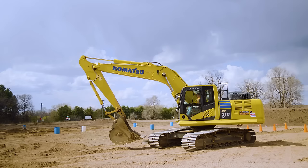There is no right or wrong here. The best way to get good at this is just seat time. The other thing I've seen, if you are trenching, we'll do another video, it gets a little bit more advanced, but once you scrape, you'll see my teeth are more to 45. So you see how that first one, I have a big old pile of dirt right in front of me. So the other thing that's really valuable is you back off your stick a little bit. Let that material fall either in your bucket or down into the trench versus building a big old pile like I did in the first one.